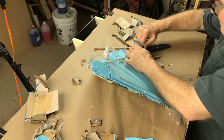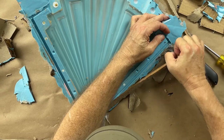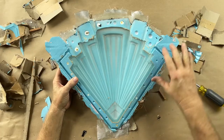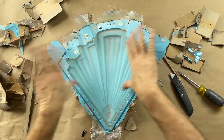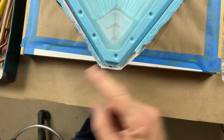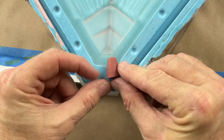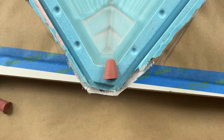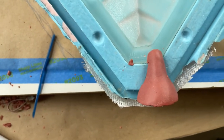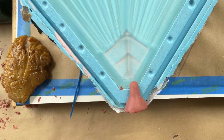Got yet another fiberglass splinter in my hand — love those. Beeswax does its job once again. It's basically taken apart and it's going to take some time to perfectly clean, trim, and finish everything. I got the mold all cleaned out. Now what we need to do is put our funnel — a single vent right here and a funnel right there. I keep old stuff so I can recycle it and make quick use of it. I broke out the wax tools and expanded that little sprue and funnel — that is going to work perfecto.